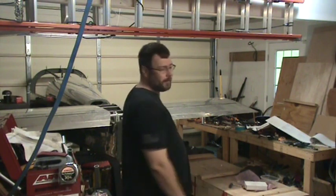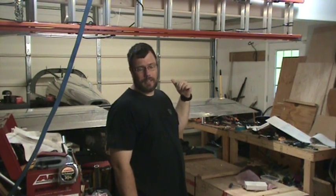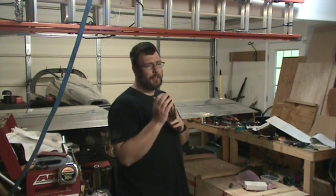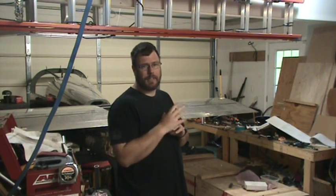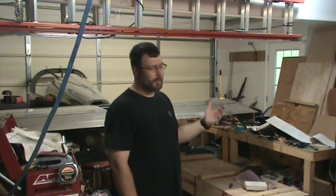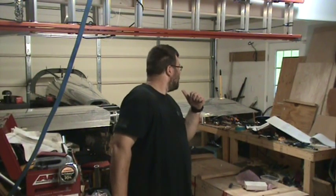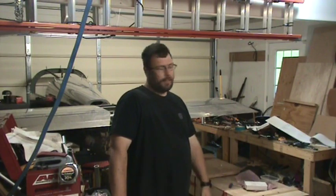The Xterra, I'm driving it now, but in the previous weeks I've been changing out the thermostat and the timing belt. The timing belt just was a mileage issue. It had broken once before, so this is my third timing belt in the vehicle, and I wanted to make sure to get it changed at the appropriate mileage before it broke. And then the thermostat had just stuck partially opening too early or something, but the engine wasn't heating up and it was causing a whole bunch of issues due to that. So that's fixed, luckily. And with gas prices, I need to get my motorcycle back on the road as well. So there's a lot of other stuff going on.